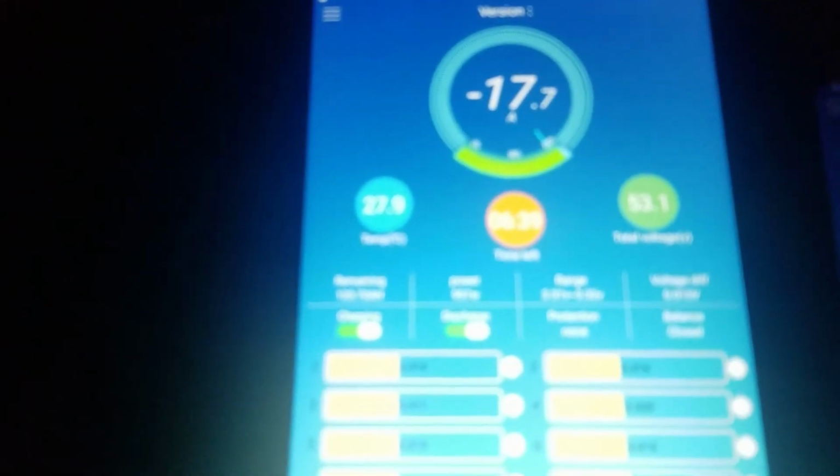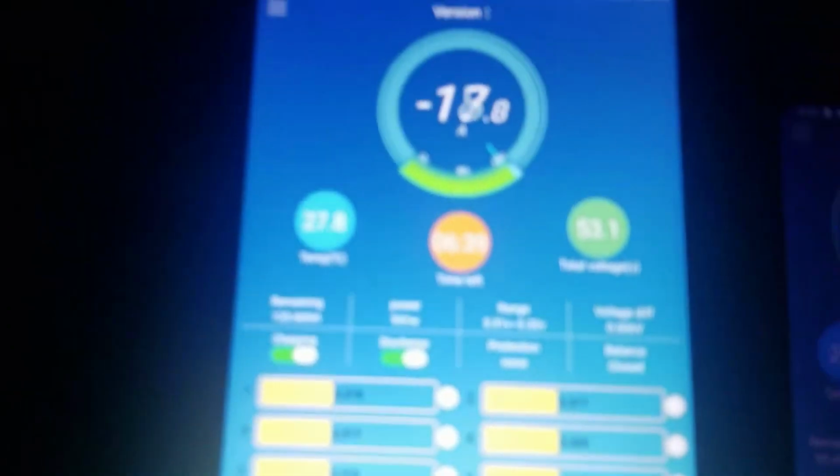Okay, I shut the light off. Yep. Now instead of burning 24 amps, those amperage are for the battery. That's DC amperage because this is from the BMS. My inverter is giving me a different amperage, but anyway, this is for the DC side.